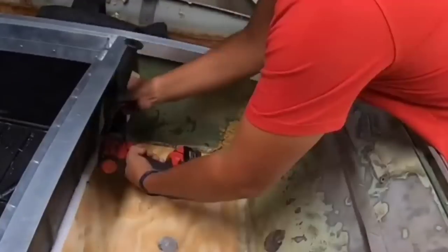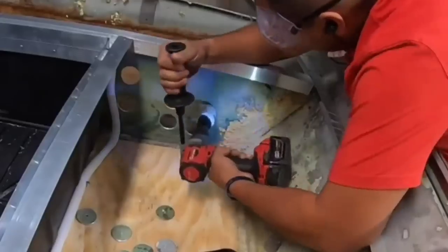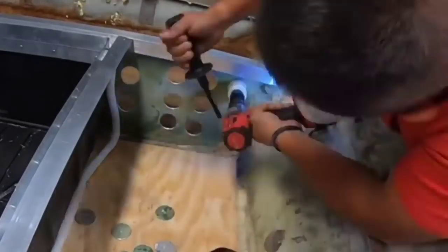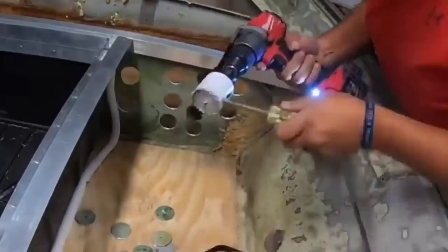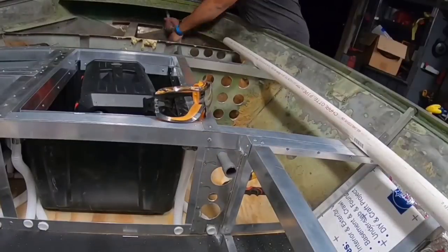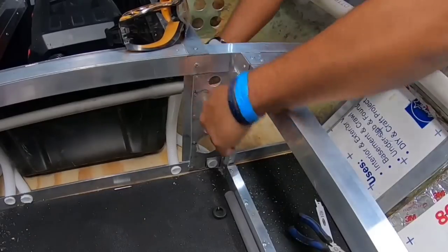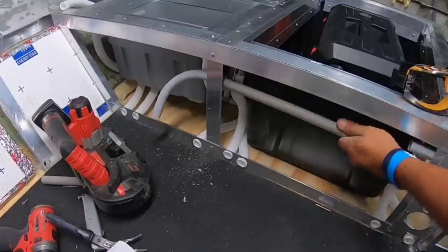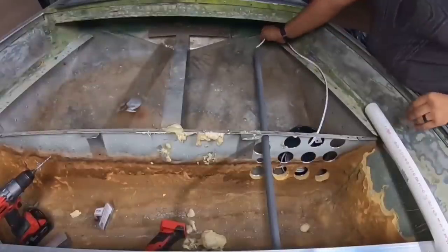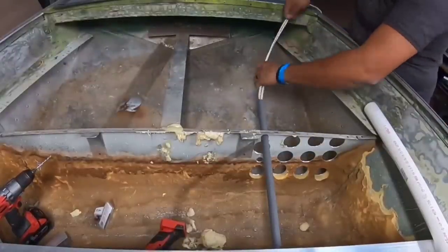With that out of the way, we can start making conduit spaces for all the rod tubes. And in conjunction, we're going to make a bunch of extra conduits for the wiring itself. I've only done that on one other boat, and I loved it when I had to go back and refabricate some things. The conduits were immensely helpful in either rewiring or adding new things. I haven't done it in a boat build since, and I've regretted it. So I'm going to do it here, everywhere.